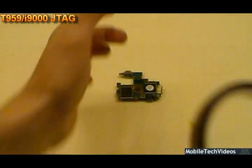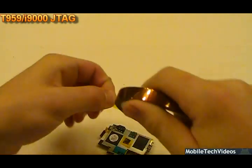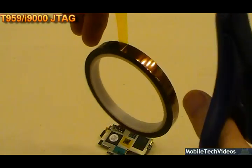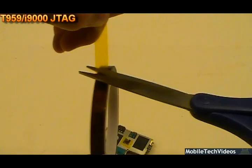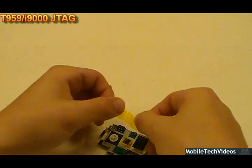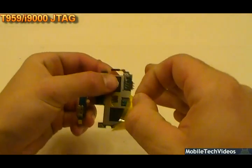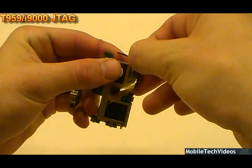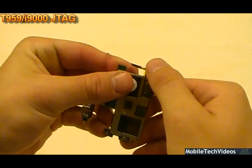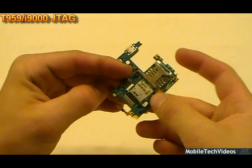All right. Here's our board. We'll go ahead and overlay a new layer of Kapton tape to fully cover up what we have exposed. Those solder points aren't visible until you expose them, so we use a detailed tool to actually wipe the board free of the green material in that corner that is normally printed on these boards, to give us the exposure we need. Then we cover this up with a piece of electronic-grade Kapton tape, and we're ready to reinstall.